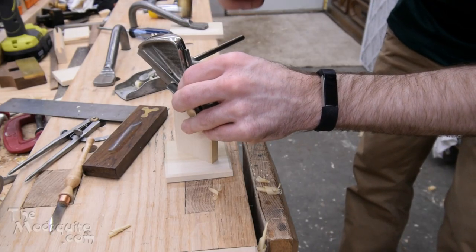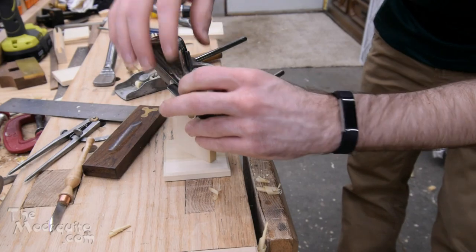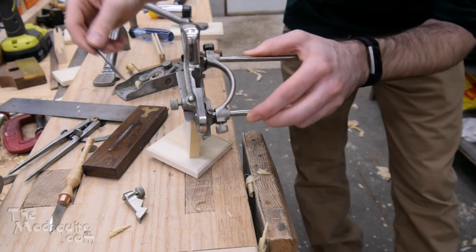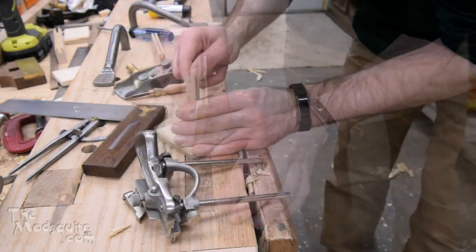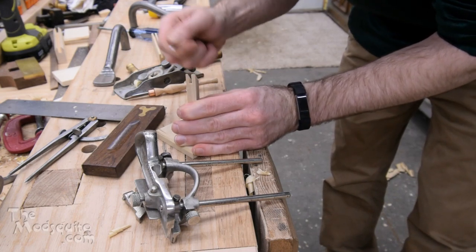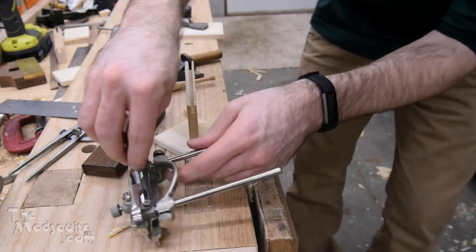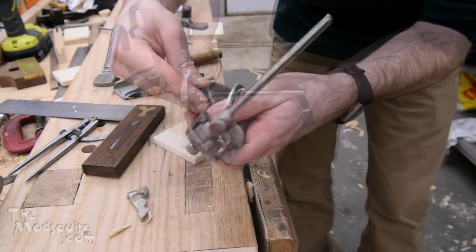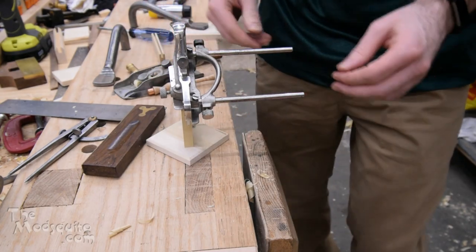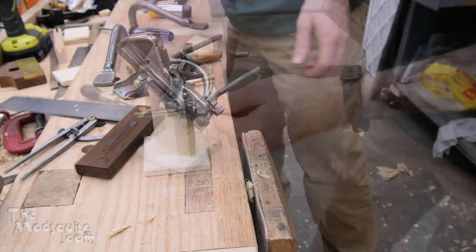Normally I have a little screw in there that hooks onto the skate that holds it in place, but this one's a little bit smaller — it's only an eighth inch wide. So what I did was I pounded the loose iron into it and now I'm just cleaning it out to make a little bit of a notch. That way when I reassemble the plane and stick it back in there, I can just extend the iron a little bit, and that notch positively seats right there with the iron right into that notch. So I'm not too worried about it sliding down and I really don't think it'll fall out either.